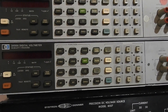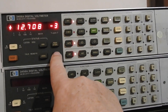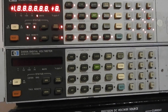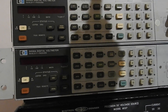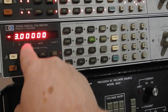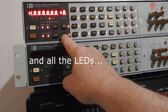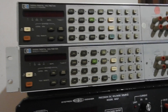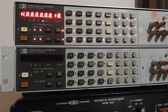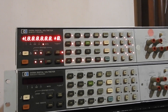Finally I found some more information about those error codes, on page 858 of the manual. When you run this test, if there is an error it outputs it on the display and on the HPIB interface. If there's no error it outputs 100, but only on the HPIB — that's why it's not showing on the display. If you do have an error, it shows a negative number. The meter does 12 different tests; the first three are digital and the rest are analogue. We're in the digital lot — test number three has to do with the isolation logic between the in-guard and out-guard sections. So I've got a rough idea where to look.